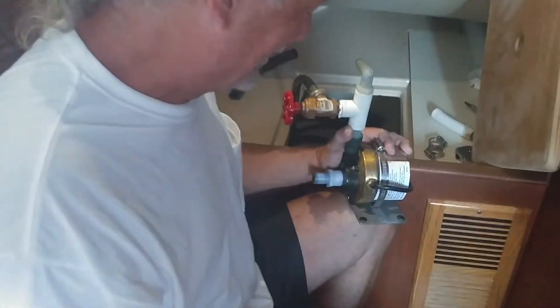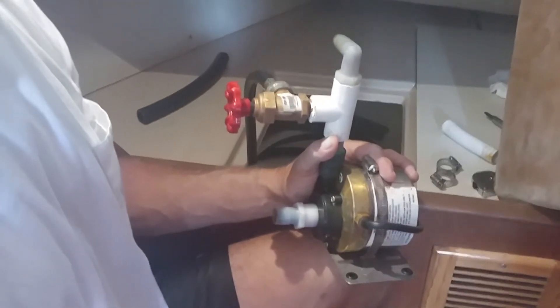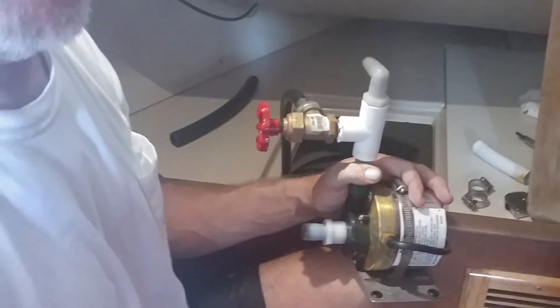Toilets — okay, that's good to know, we might talk about that later. So what are we doing here with my AC water pump? We are adding some line and taking this pump which was mounted high and making it mounted low, so that it'll be below the waterline, so that it will keep a prime and won't keep getting airlocked.